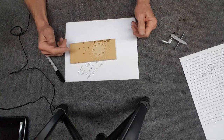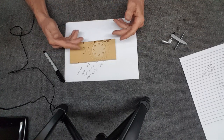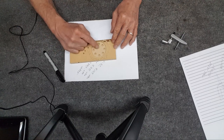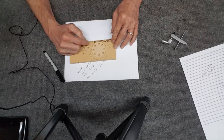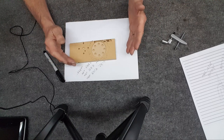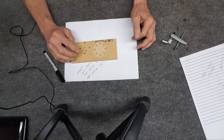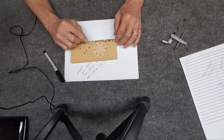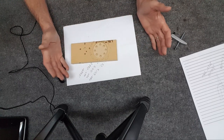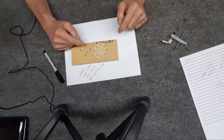Side note here, I was just doing some playing around with the CNC, saying, let me make something a little bit more complicated, and it's pretty easy to work with. This was going to be a flywheel. I forgot to do the center hole, but yeah, it can easily do the center and then these holes, but I spent hours and hours trying to get it to do the outside of a cylinder, and it would not do it. Turns out it's a bug in the software. I'm running version 0.17. They came out with version 0.18. 0.18 works, it'll do it perfectly. So I kind of gave up on this for now because I did accomplish what I wanted. I wanted to try to do something a little bit more complicated. So if you're running FreeCAD, go get the latest and greatest.